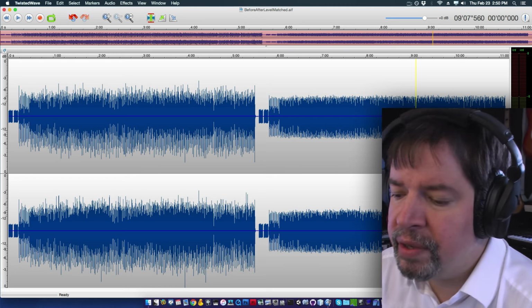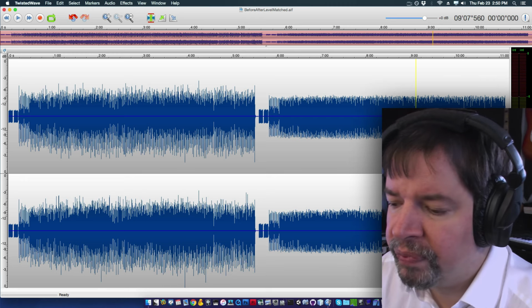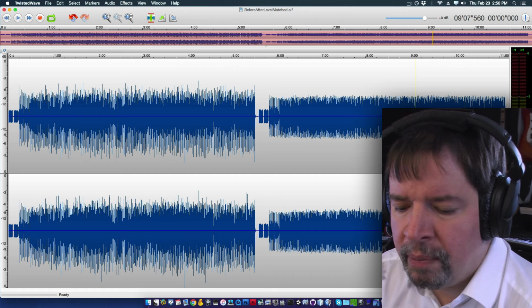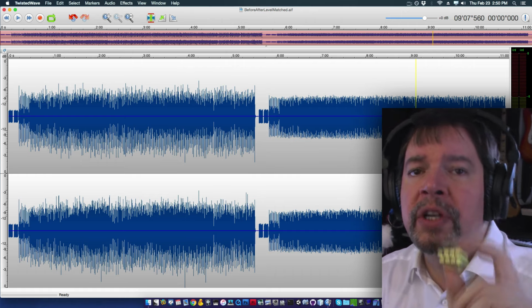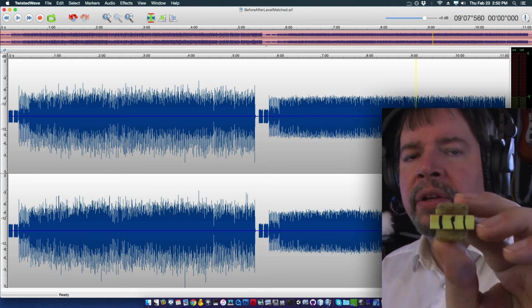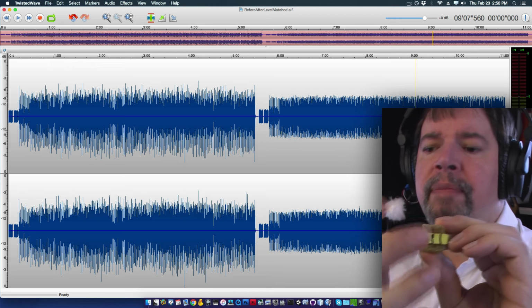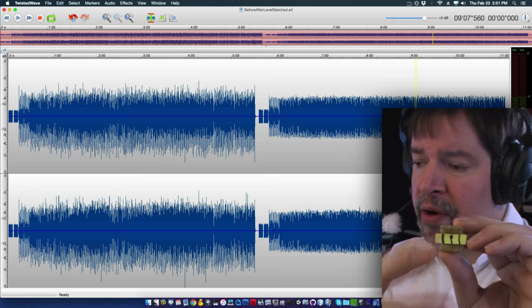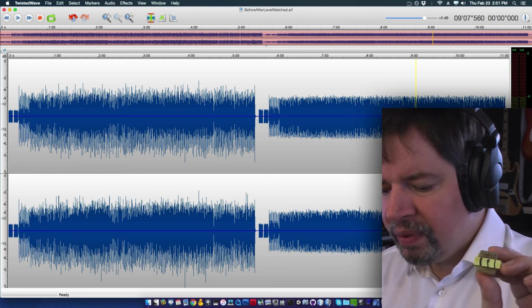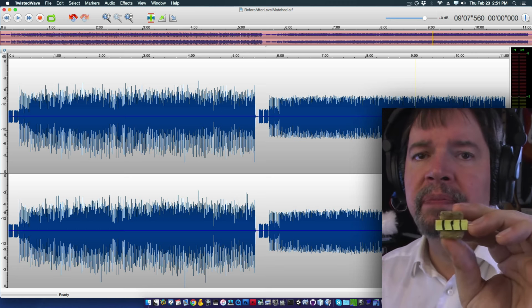Choose wisely, because this will have everything to do with how well your infibulator works. The thing is, I can't tell you how your transformer is wired. This is how it worked for mine. You wire one side of it one way, and then try both wirings on the other one. You solder it and unsolder it and so on. One of those connections is going to be much, much higher gain than the other.